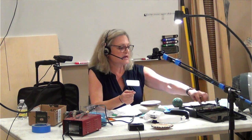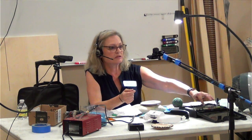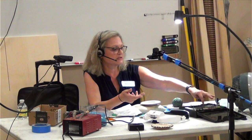Yes, but I've also included now I'm using the NSK, which is a dental tool running off the compressor. Pneumatic is the word I was looking for. And that, you go finer. The bits for that are like a 1/16 inch, as opposed to the 1/8 and what is it, 32nd. Yeah, and it doesn't skate as much, and you can get into some fine, smaller stuff.